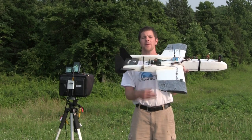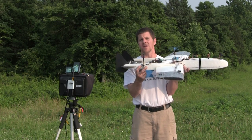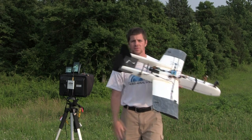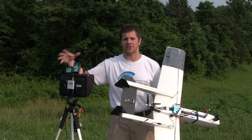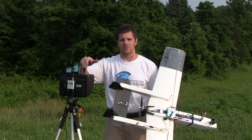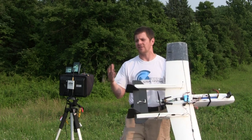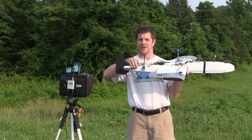In this video we will be using a TBS Greenhorn 25 mW FCC compliant video transmitter. For the antenna, we will be using the left hand circularly polarized air blade. For the receiver, we will mix a couple different antennas to investigate their performance: first the air blade, then a three turn helical, then a 10 dB IC crosshair, and finally the 13 dB IC pepper box, to see what kind of performance each of these receiver antennas gives this 25 mW transmitter.